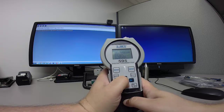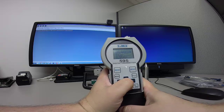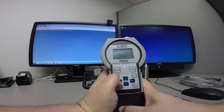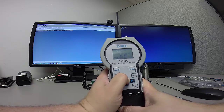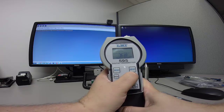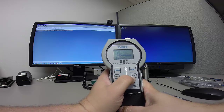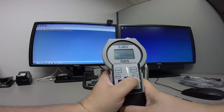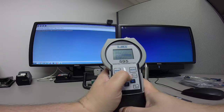And my cal span is also set to 10 mils, which the TP that I'm using only has a cal span of 4. So I'll need to change that as well. I'm going to take this, put that down to 0, come back here and make this 4. Press select to save it. And now also, I want to make sure that this read is set to off. This could be set to manual, but for our purposes today, we're going to use it set to off.